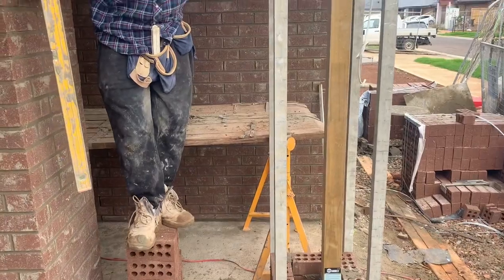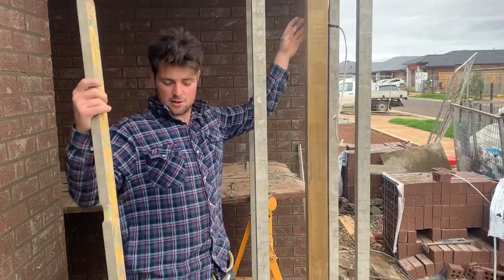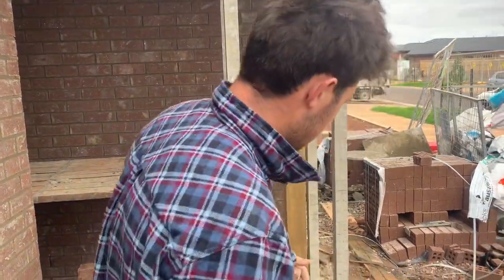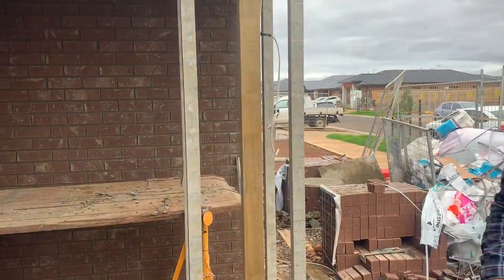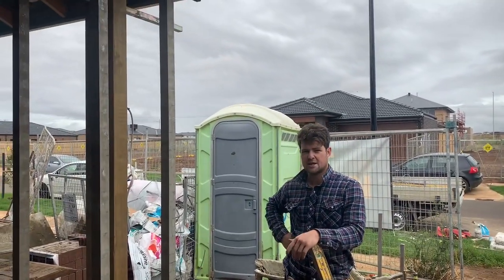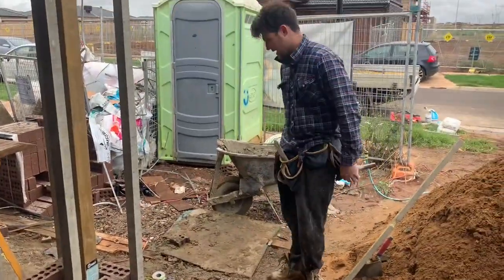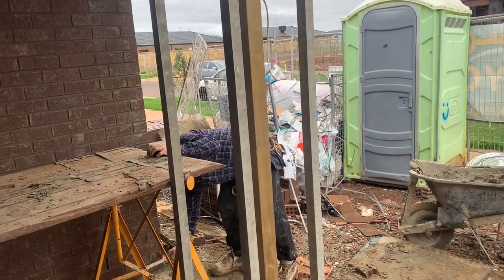Now I know that might take about five minutes or so with the help of Sauce. By yourself it might take ten minutes to set up, and by that time you could already have it half the way up. But if you're setting up a pier for an apprentice or one of your workers — so you don't have to put your level on every course — just take five to ten minutes to set up and you're ready to go.